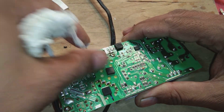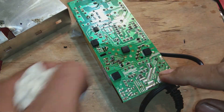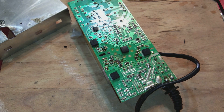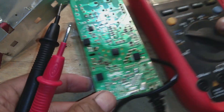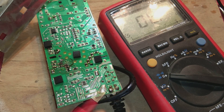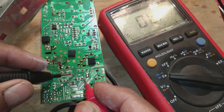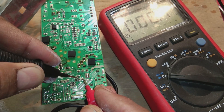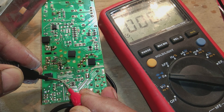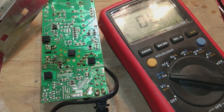Let us check if the output stage is damaged. I think there will be a short in the diodes in the output stage — the rectifiers. There are two diodes here in parallel, in a transistor shape, mounted on the heat sink. On the continuity range there should be no continuity on diodes, but they are showing continuity with zero ohms. This is not good — it seems there is a short circuit in the diodes or somewhere else appearing on these diodes.